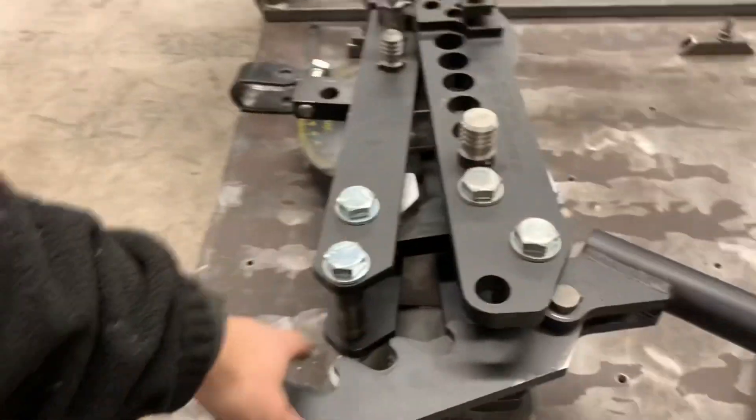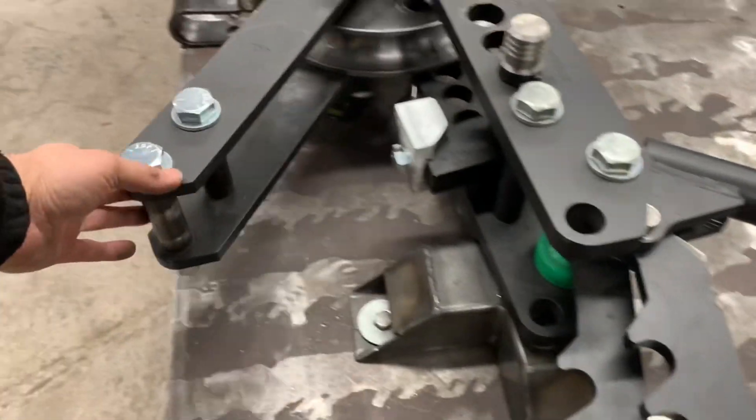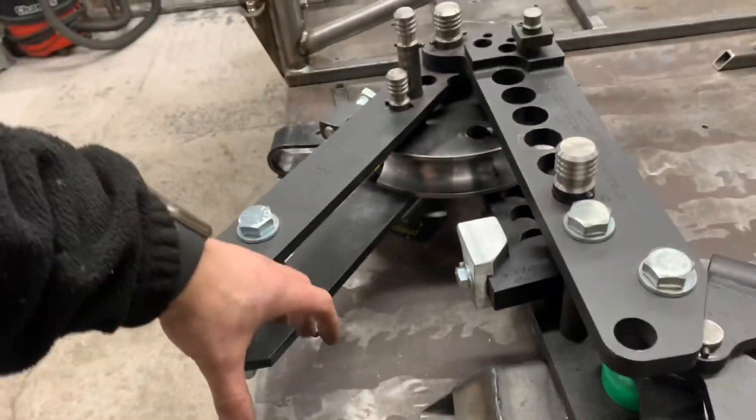What I'd like to do is go hydraulic. If you can go hydraulic, these benders all come set for it because that's what this bracket holds for - you get an adapter which changes this shaft and the ram sticks out here. I've looked and the cylinders are about £350, which is a lot of money for a hydraulic pump. They also do an air-over-hydraulic which I've looked up on YouTube, and for about £300 to £400 it's not that bad. Or you can use the pump off one of those quick-lift car hydraulic jacks - it does the same job.